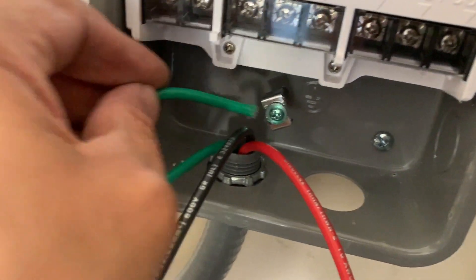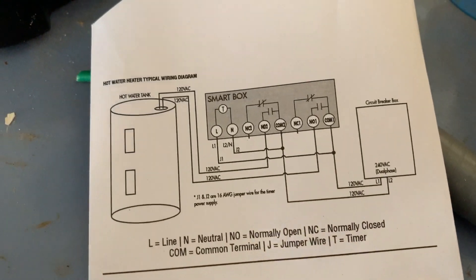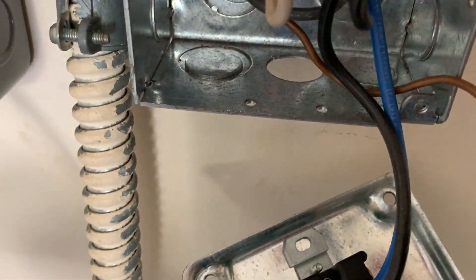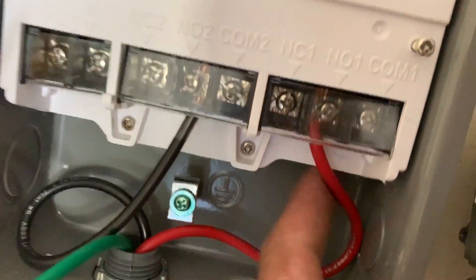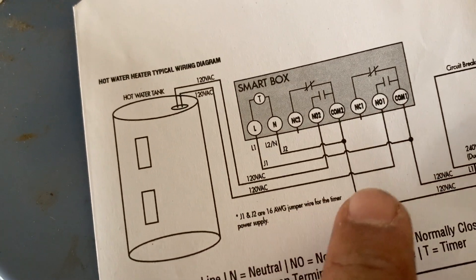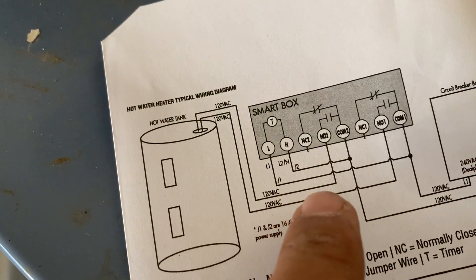This wire I'm going to put to ground. The green wire is earth or ground, and that's where it belongs. I connected my wires to NO2 (normally open 2) and NO1 (normally open 1), and remember — everything is de-energized at this point. I'm starting my wiring from the load side.